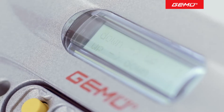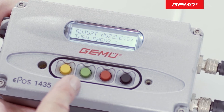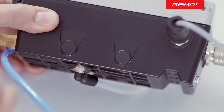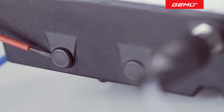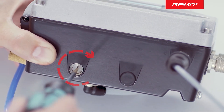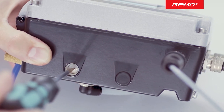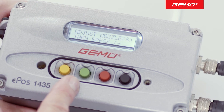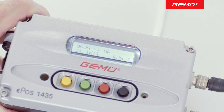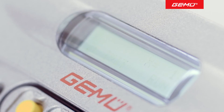The positioner then interrupts its routine. Continue to follow the instructions on the display. Specifically, press the green button with the right arrow symbol once. The display indicates that the air throttle now has to be adjusted. This is located on the bottom of the positioner under a protective cap. Remove the protective cap using an appropriate tool. Rotate the air throttle once in the clockwise direction to change the setting — this causes the valve to react more slowly. Then press the yellow button with the left arrow symbol once. This restarts the process for determining the reaction time. If this is now above one second, initialization is continued.